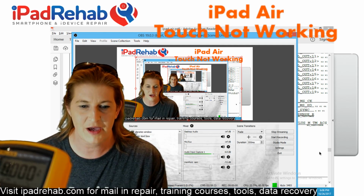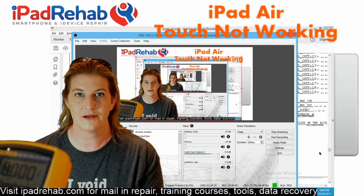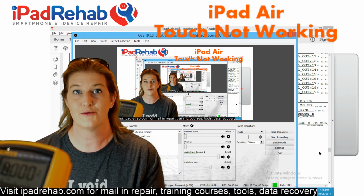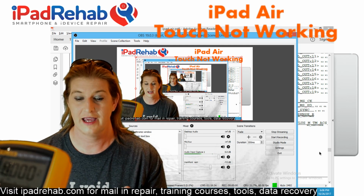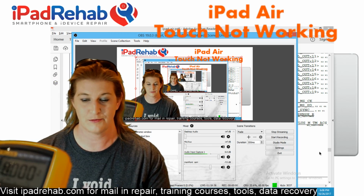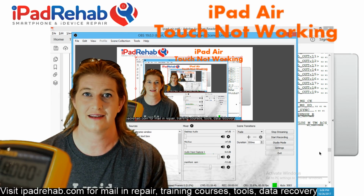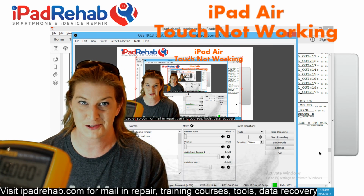If you think about it from a really logical perspective: look for the problem, look at the line level, problem line, why? Short, open, or not being produced. And then if it's not short, it's not open, why is it not being produced? Move the problem back and start thinking again. Think about how things are told to turn on.